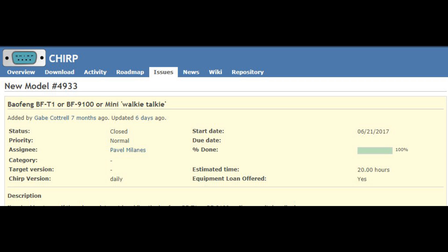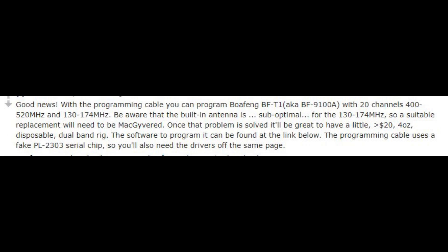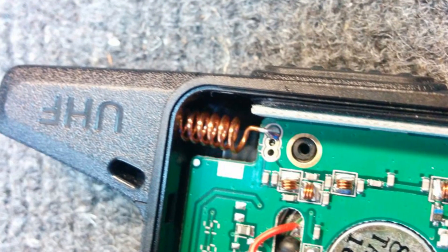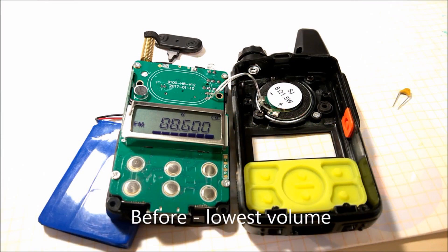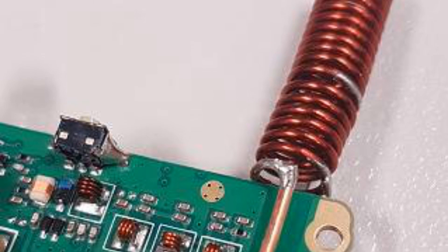It appears that people prefer to use Chirp when they program these PMR radios. Originally I said that the T1 wasn't compatible with Chirp, but I did a little bit more digging and it appears I may have been wrong, because it now looks like it's included on the Chirp list. Another question that's come up is whether this radio is in fact a true dual band radio - will it work on VHF as well as UHF? The answer is both yes and no. The software will program the radio to use VHF frequencies, but the built-in antenna is tuned to UHF. So the radio can be programmed to transmit and receive on two meters, but the range is going to be pretty limited due to the antenna problem.